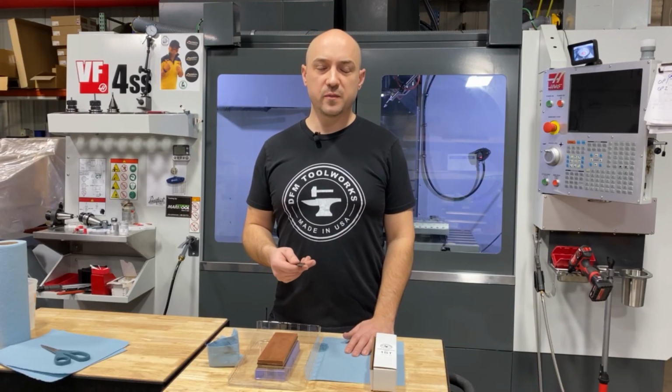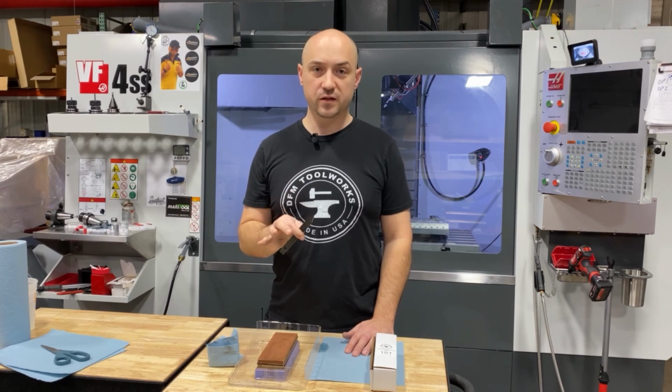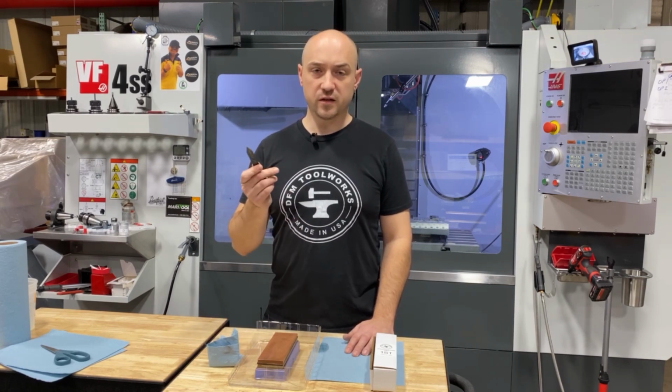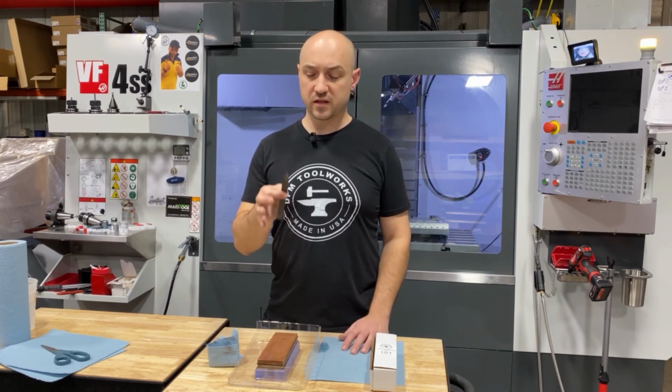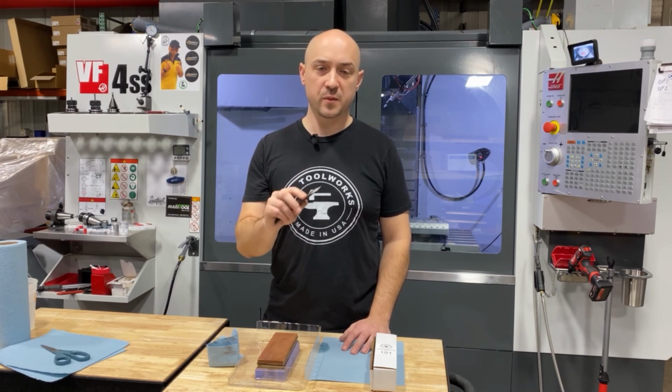So as you can see, a microbevel is extremely small, but a very easy way to quickly sharpen your blades. Just a couple swipes on each side and you're back to as sharp as you were before. So not only does it save you time, but it also keeps the etching from the primary bevels here in the factory.